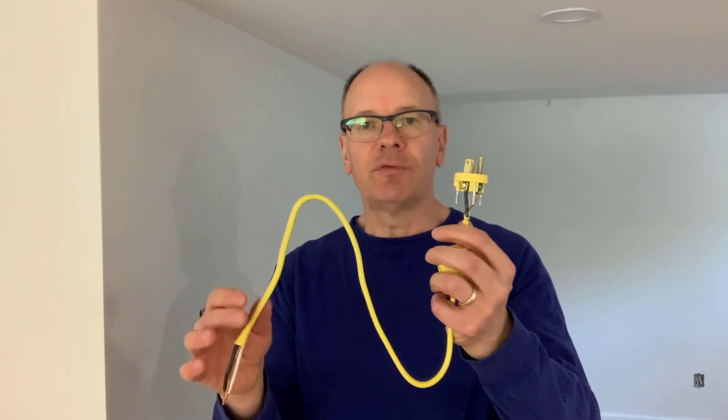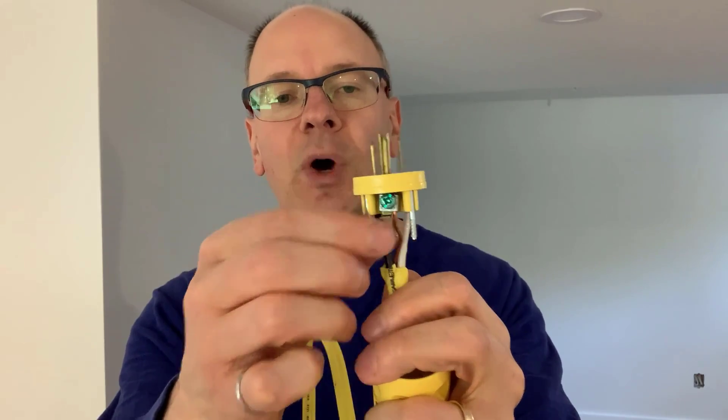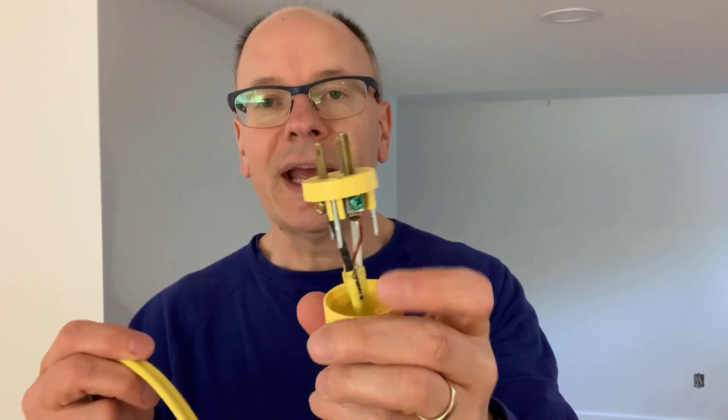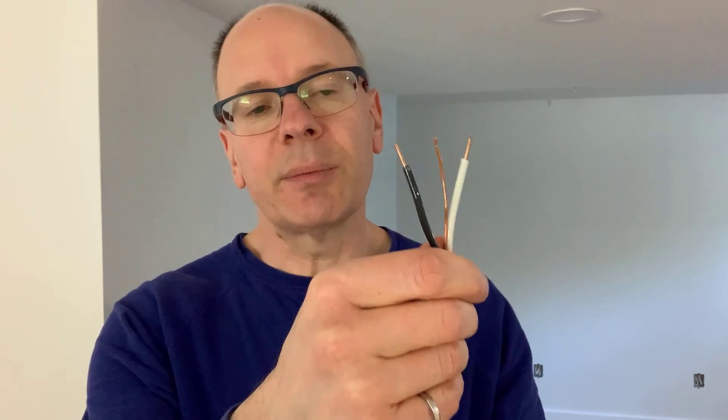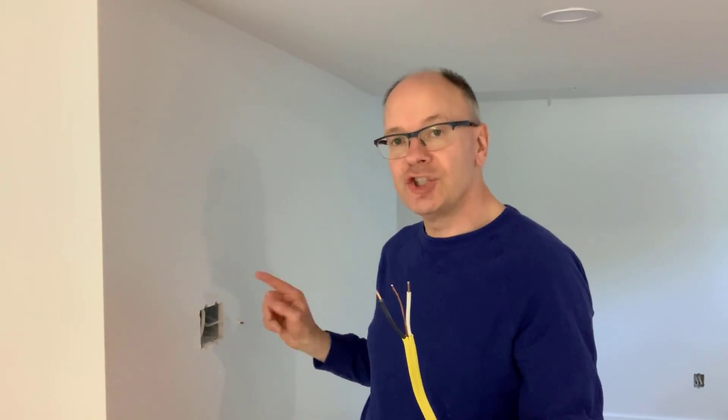Here's how we're going to get power to this cable. I'm going to use this — it's just a section of regular 12-2 Romex that I had left over from another project. On one end I've connected a three-prong plug. You'll notice there's the black, the ground, and the white that you connect. I've just stripped the wires back so you can see what it is. On the other end I've stripped a bit of wire from each of the black, white, and ground connectors, and I'm going to connect them to my wire using the inline WAGO connectors.